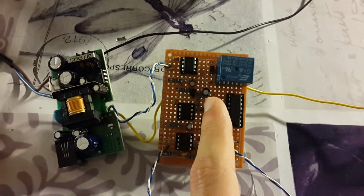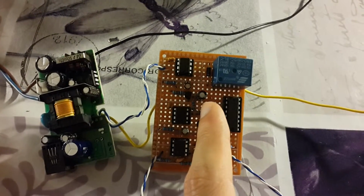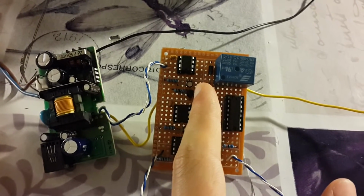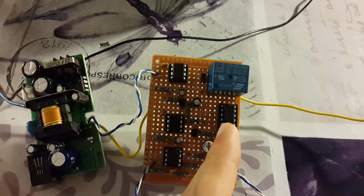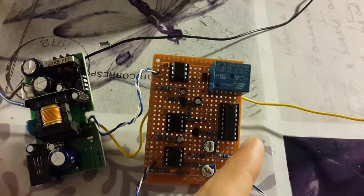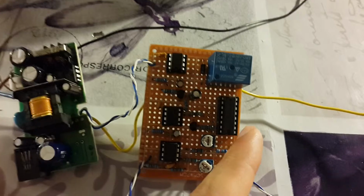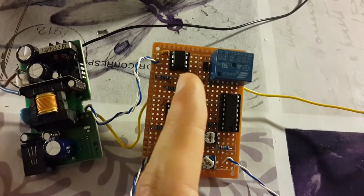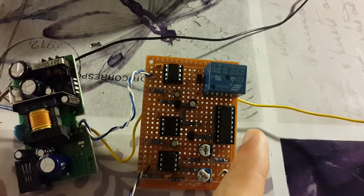However, while the first timer is on, it makes sure that the delay capacitor of the second timer is charged, and thus the second clap, once it comes, will turn on the second 555 timer, which will give a rectangular pulse which goes to the clock of this JK flip-flop. Both J and K are held high, so that the flip-flop constantly changes states with every trigger at the clock entrance. So once this second 555 timer gives the pulse, the flip-flop changes state.